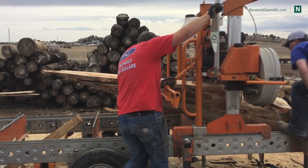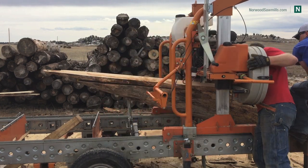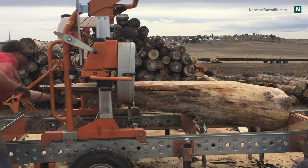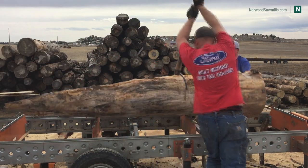So you want to avoid that if possible. I'm not gonna try to reset it back into position because that's just not possible and I don't want to screw up the rest of this cut. So I'm gonna change the blade out because it just bent the blade, and I'm gonna flip this log over and start over from the other side. That two-inch slab I was just trying to cut is gonna be my last slab to come off the mill.